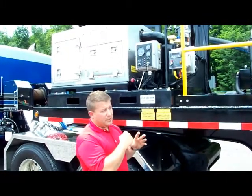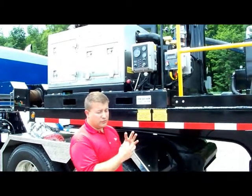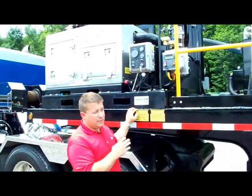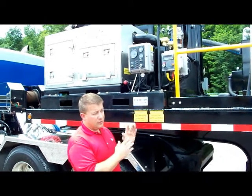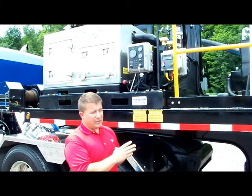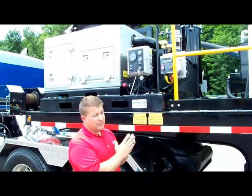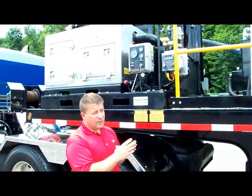You may have to draw a little bit more vacuum down and continually go around the worm screws, the wing nuts, to tighten up the gate to keep it from leaking under pressure mode. Then whenever you want to release the gate, we'll draw the vacuum down, you can take it down to 24 to 25 inches of vacuum. That'll compress the gaskets even more, so it's easier to undo the wing nuts. You want to keep the lid under vacuum till all of the wing nuts are off.